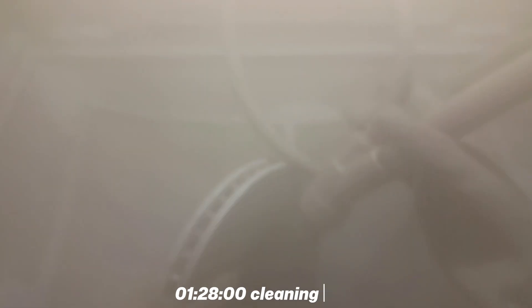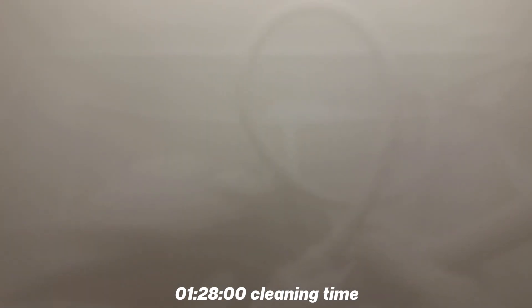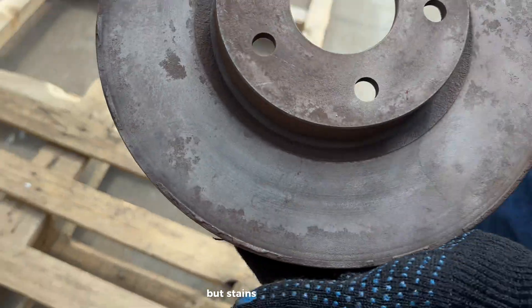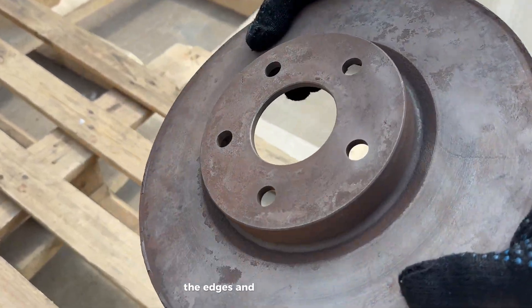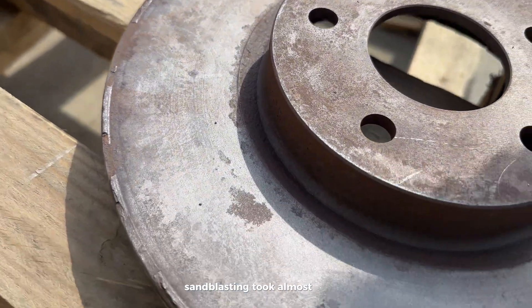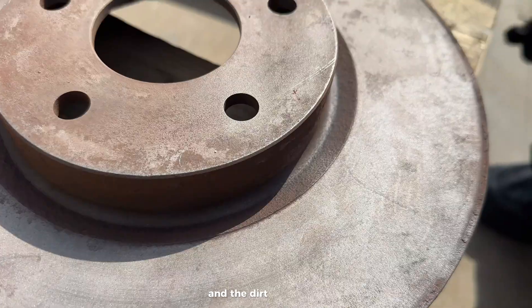Visibility after five minutes of cleaning is almost zero. However, you can see much better on the camera than with the naked eye. It is necessary to work in a mask during cleaning. The disc is about 50% clean. The main layer of rust has been removed but stains are still visible. The edges and hard-to-reach areas are not fully cleaned. Sandblasting took almost an hour and a half and the dirt is still there.